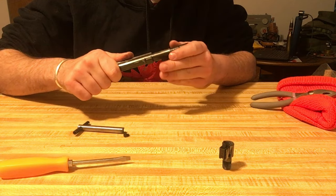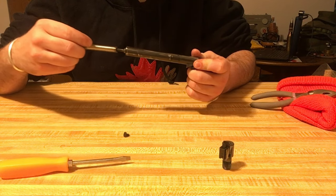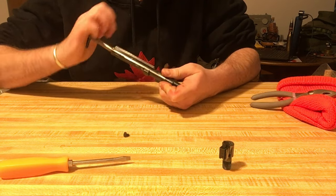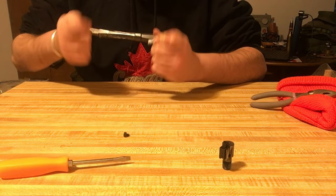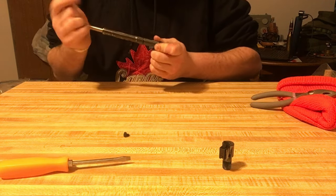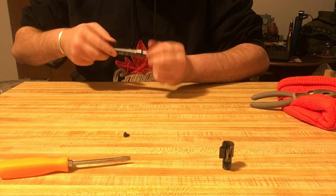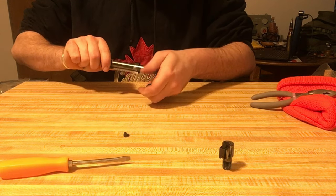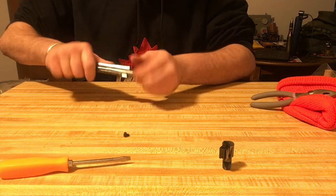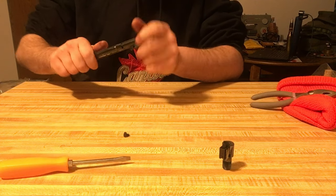For reassembly, make sure your firing piece is lined up with the bolt body, get the tool aligned, and start threading the firing pin back into position. You'll know when it catches because it will stop trying to fly across the room. It can be a bit of a pain to thread if the threads are marred up or if things are dry.